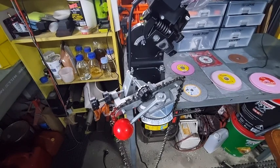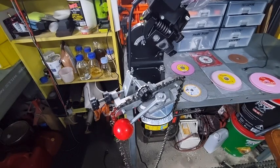So with all these wheels that I've got, I will use them. It just means that you need to go a little bit slower and just take your time, and you'll find out it'll grind well. So just to recap, all your pink aluminium oxide wheels, especially if they're in a higher grit around 100, they will generate a lot of heat. Do not use 100 grit on an aluminium oxide wheel unless you're prepared to go as slow as a snail. 80 grit would be the maximum I'd go, so either 60 or 80.